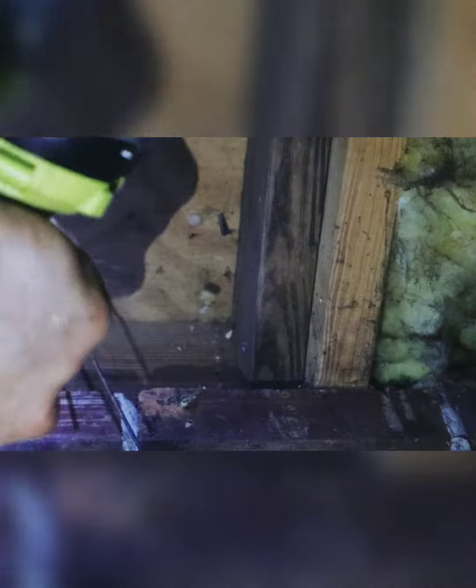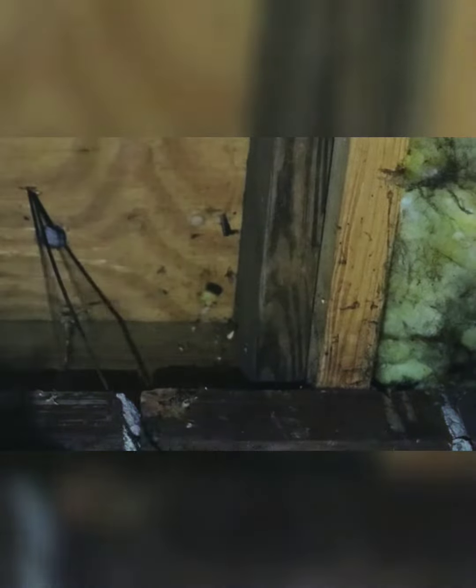You're right next to the trim, so you go back a couple inches and you'll come directly up into the wall. Then I shove my wire up the hole — right when I'm reaching the hole, the wire's sitting right there to pull up. Then you pull the insulation barrier holder back out and there will be no marks on the floor and you will not see the hole at all. You gotta admit that is a hack that no one has shown anybody yet.